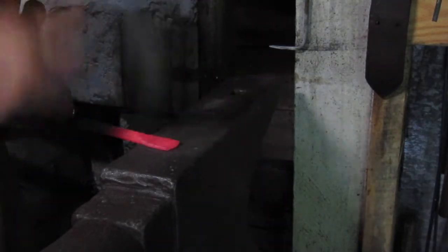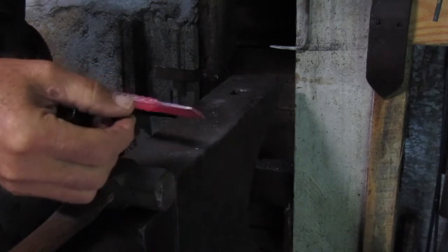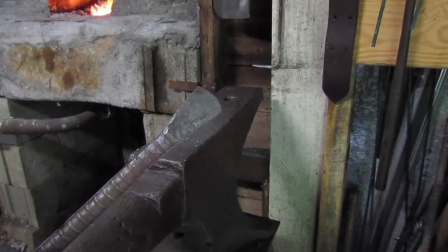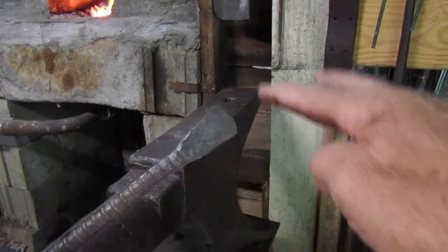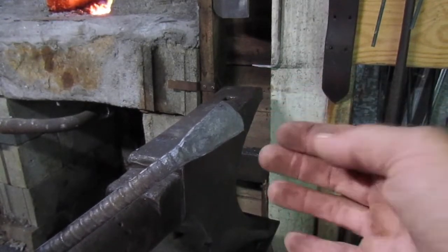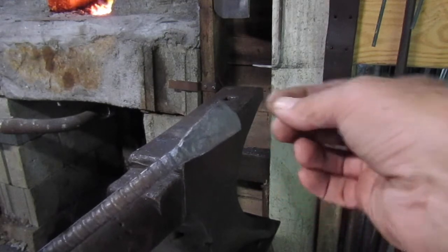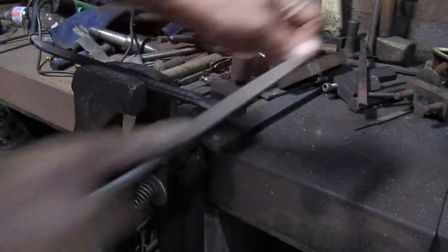Go down to about a little less than an eighth of an inch thick. That's just about right when we turn it up — now that's long enough to make this drill bit. What we're going to do next is actually thin the edges down with a file or a grinder and round this over on the end to make that shape before we cup it. That way there will be no cold shuts in your edge or the tip of your cutter. A cold shut is where you fold over a piece of metal and leave it in there — when you go to sharpen it or try to use it, that cold shut will show up in the edge of your cut. Doing it this way will save you a whole lot of time on sharpening your bit.